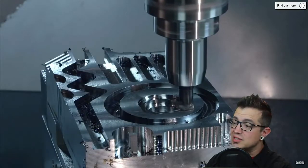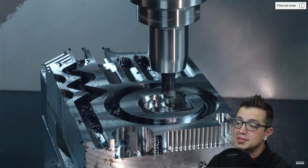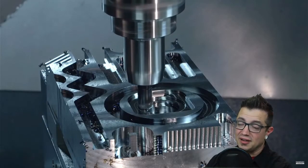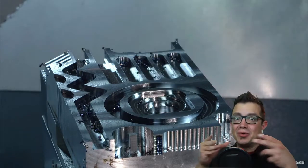The tolerances you can hold within a couple of tenths, depending of course on your machine tool, your fixturing, and the rigidity — because if your part's shaking around the table, it doesn't matter how good your tool is. One of the things I really look for in an indexable end mill, like the Sandvik Coromant 390, is the versatility and the adaptability. I love having that one tool in the carousel that I know I can throw any insert on, tackle any material class, and it's predictable.